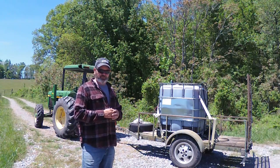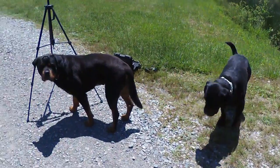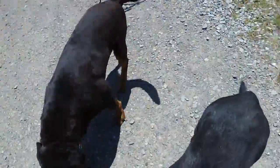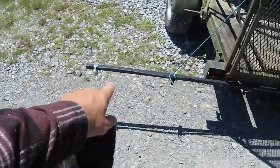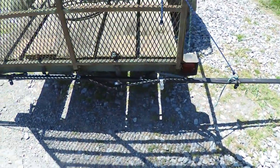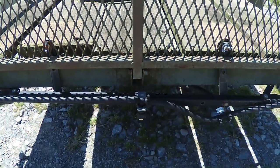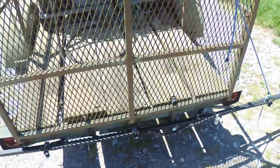Let's take a closer look here and I'll show you each individual component I use and how I put this together. The spray boom on the back here was actually the boom off my little 60-gallon Tractor Supply sprayer — I just repurposed that, made a couple of cheap little brackets, and I even used wing nuts to hold those in place for easy removal. All I have to do to take this boom off and use this as a trailer again is just take those two wing nuts off, pull that off, and disconnect that hose. It doesn't take but a minute. You may wonder why this long hose is coming out of the back with a pressure gauge in it — that was the sprayer wand hose off the manifold; the cheap plastic wand broke, so I just stuck that in there to plug the hole and haven't got around to replacing it yet.